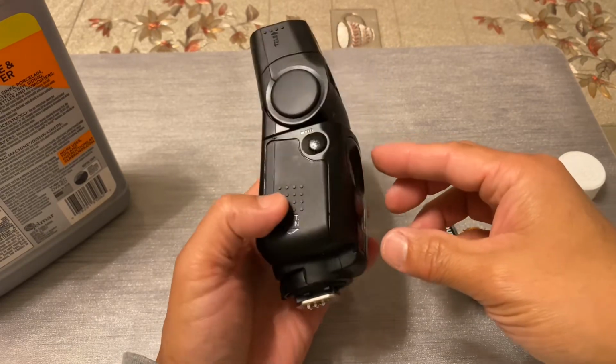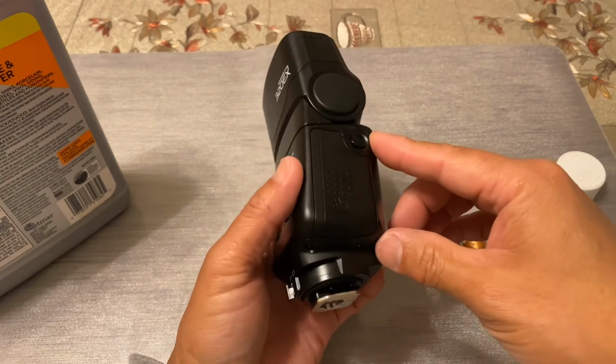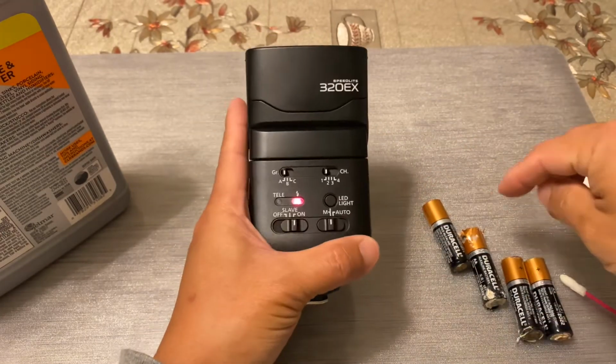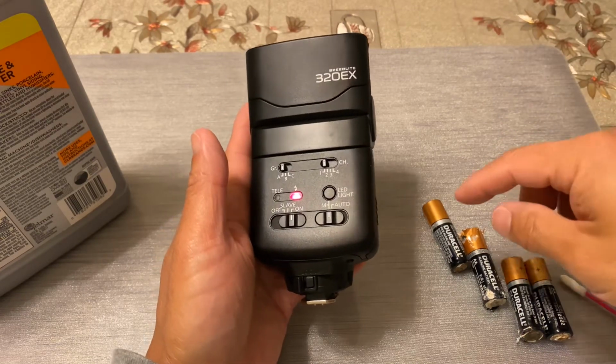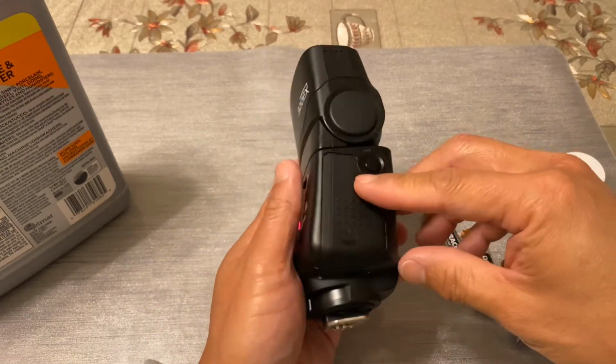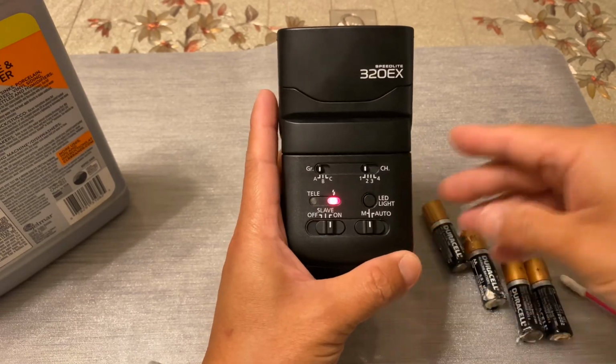So that's it for today's tutorial. Remember, don't throw out any electronics where you have battery terminals that have been corroded with dead batteries. Go ahead and use CLR, clean it up, and you might be surprised that you can get it working again. Thank you for watching.